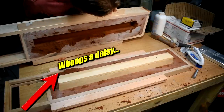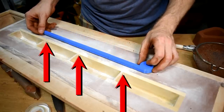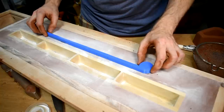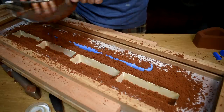I'm using Petrobond sand — it's super sticky, and you need the parting powder to make sure the two halves don't just fuse together. My plan is to run the metal alongside the mold and feed it in at each of these three braces, so the metal can enter the pattern and go all the way to the opposite side right away. I 3D-printed all these runners, a spin trap, all that. Just know you don't need all these fancy extra bits — people have cut channels with spoons for a long time perfectly successfully. I used to use a copper pipe. These runners' cross-sectional area is about the same as a half-inch copper pipe; I usually use much smaller runners, but I usually make much smaller castings.